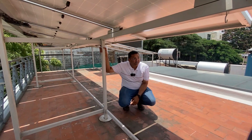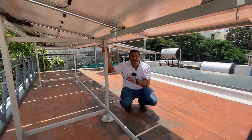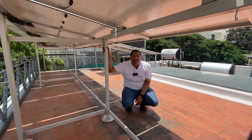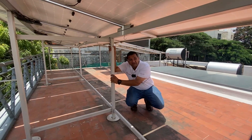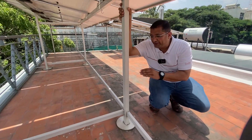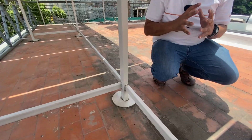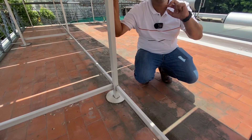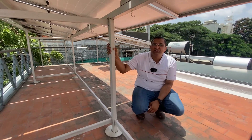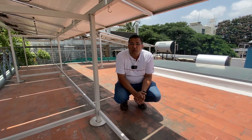Now we are below the structure. Unlike previous videos, this is a relatively smaller structure in terms of height — generally we see elevated structures with walkways and plants below. This is a pretty conventional structure. However, even here we have not done any cutting, drilling, or puncturing on the roof, and we have not used any kind of ballast. The structure is designed so that all 22 panels are held by self-weight and pipe beams, taking support from the parapet wall or grill — no disturbance to the roof, thereby protecting the waterproofing.